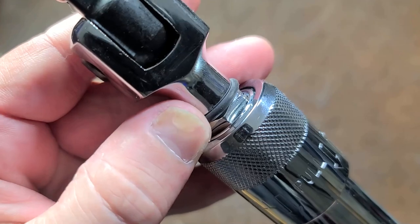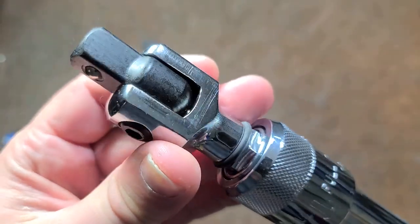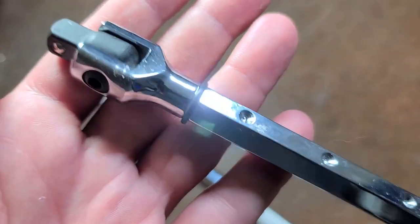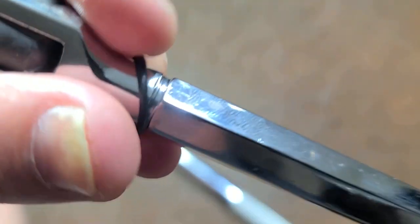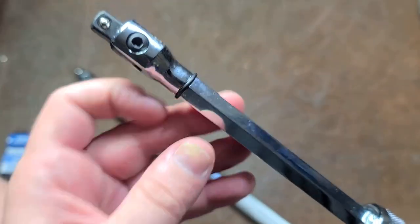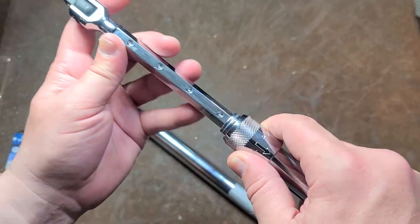Take a quick look at the head, the little O-ring there. Kind of a bulbous and square head with just kind of a standard forged anvil. The Quinns are exactly the same — this is the 3/8 version. As I mentioned on the Power Torque, since they have this undercut here, if this thing breaks, it's either going to be the anvil that shears off or it's going to snap off right there at that stress-riser where they've undercut it. It just has a ball bearing and a quick release.